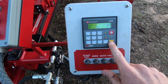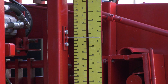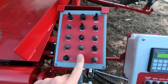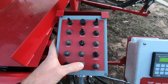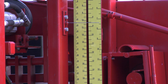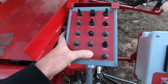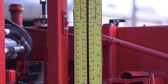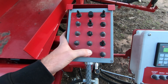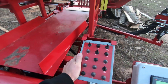When we go to our cant setting, we'll go to six, enter — that's going to bring us up for a seven inch cant with a four quarter board. I want to bring my blade up to where I want to start at the log. Hit the go-to button and that will pick the head up. Start cut will bring the head down to where I want to make my first cut. Make the cut, start cut raises the head, bring the board back. Start cut drops it down, make the next cut — we repeat that process. We're cutting inch and an eighth board for the seven inch cant. That ends up at seven inches on the last cut. I can hit start cut to raise it, but I can keep pushing this button all day and it will not go down — we were at seven inches, that's what it's set for. It has finished its sequence and won't do anything else.